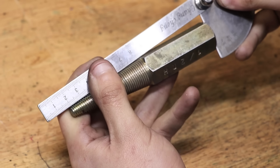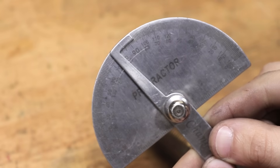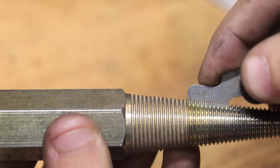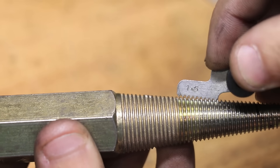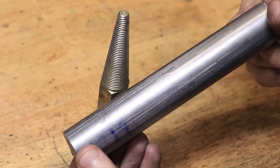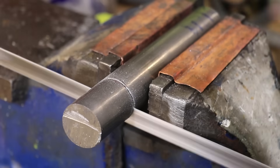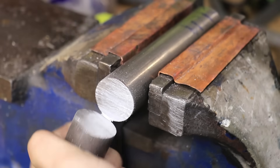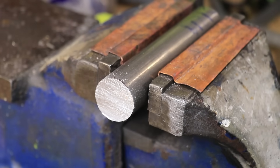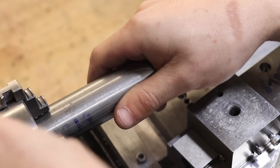The taper on the mandrel comes out to about five or six degrees and the pitch seems to be about 1.5 millimeters, which is really strange given that this is an imperial internal thread. To cut tapered threads there are definitely several methods, but the method I'm going to use is hopefully the easiest and most suited to my small lathe. To do this I'll need the old cross slide back on the lathe, and I'll start off by chucking up the part and cleaning up the ends.